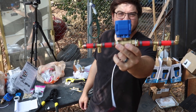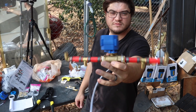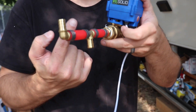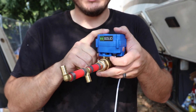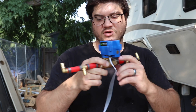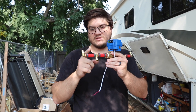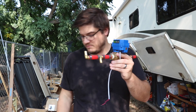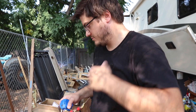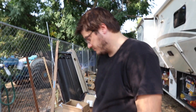First assembling — hey, look at that! So this will have a check valve here, and this will be the return. This will close when it's in loop mode, and that will allow this to go out to the heat exchanger and allow this to come into the shower head. So there we go — now to make the other one. We have to make a second one for the cold supply.